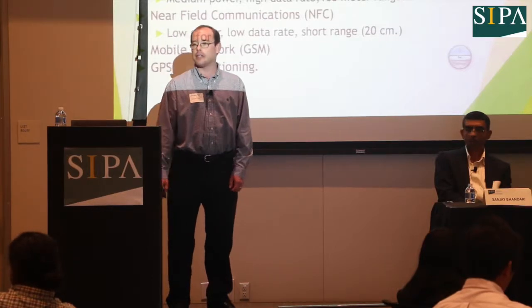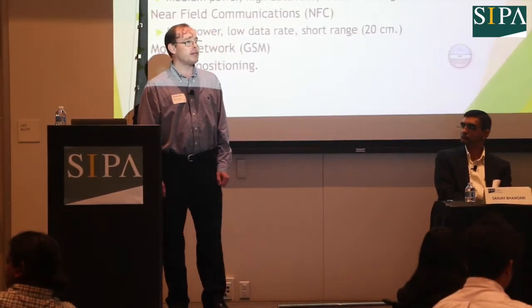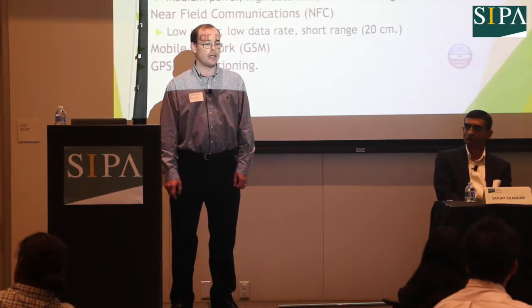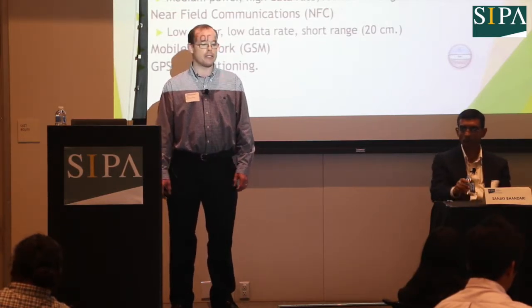The other technology that's often considered is wireless LAN or Wi-Fi, and the main drawback of using Wi-Fi on a wearable is that it consumes more power than other technologies like Bluetooth, for example. But on the plus side, it's orders of magnitude faster. And the last one that I think is useful for wearable devices is actually NFC.